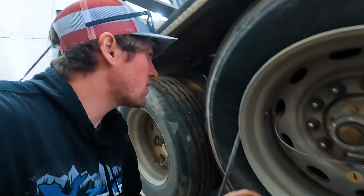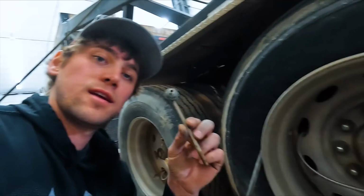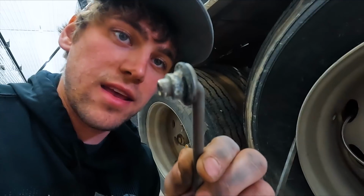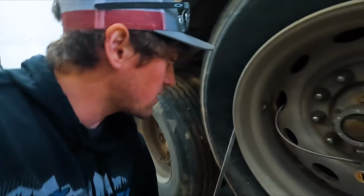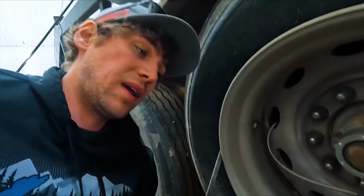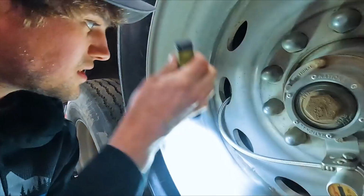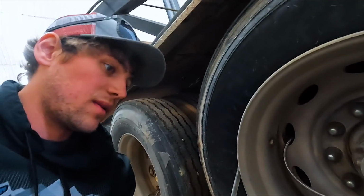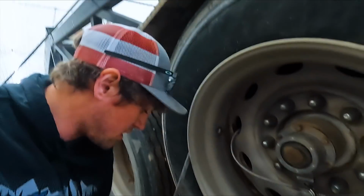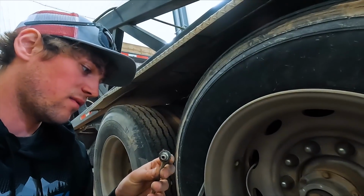So this ain't so bad at all, actually. I broke the bead, got a pry bar in there, and I got it out. Look at the corrosion. Unbelievable. That ain't maybe where the biggest problem is in the hole. The worst is right on the face here where it was leaking. So I'm gonna take and sand that down a little bit and clean up my O-ring. I think it should be good, hopefully.